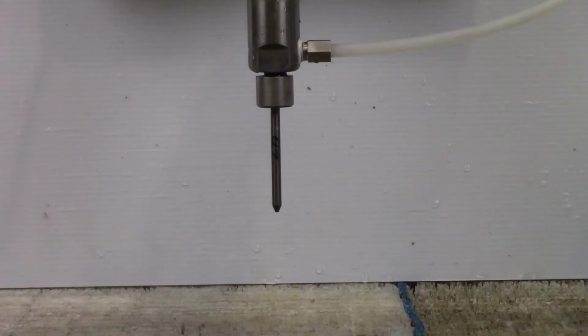For proper life, it is best to seat the orifice. To do so, turn on the cutting head, turn on the intensifier pump, and slowly increase the pressure. When the pressure reaches the maximum, cycle the cutting head on and off rapidly, 3 seconds on and 3 seconds off. The machine is ready to be put back into service.